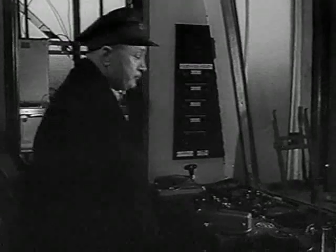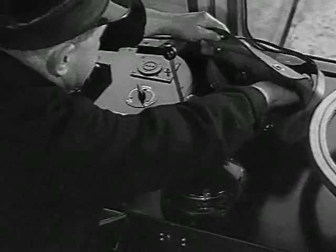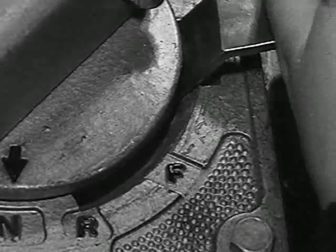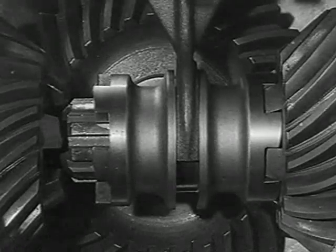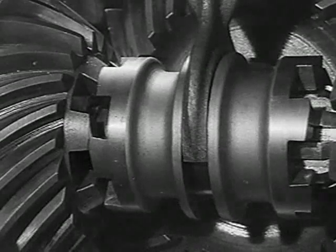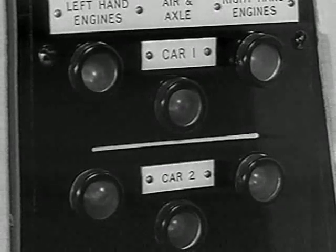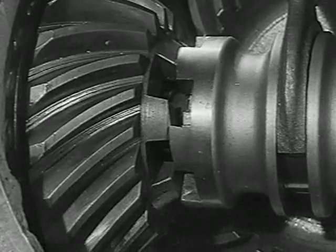The compressor driven by the engine has now raised the air pressure to 75 pounds — the minimum satisfactory working pressure for the cab controls. First, click the brake handle. The reversing lever controls the position of the dogs in the final drives. As you select forward direction, a piston pushes the dogs into mesh in number one final drive. In number two drive, the dogs moved over but did not mesh as the teeth were not opposite each other — that is why the air light has not come off. It will only light when both drives are in mesh and the air pressure is at least 75 pounds. As soon as the engine starts, the oil drag will turn the dogs sufficiently to mesh.